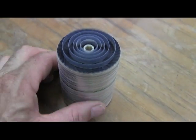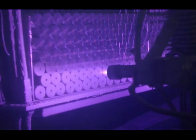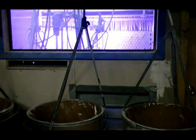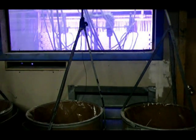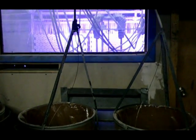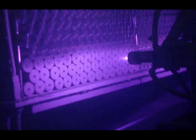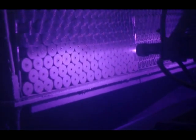Here's how the windings look after they've been wound. After the windings are wound, zinc is sprayed onto the windings. The gun pulls zinc wire from these 500 pound barrels of zinc. The gun controls a delicate balance between two zinc wires. Each wire has an opposite polarity thereby creating an arc. At the same time, air blows through the arc and sprays zinc onto the windings.